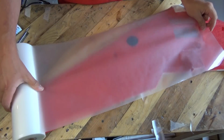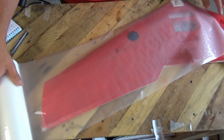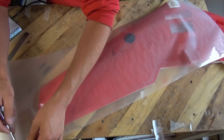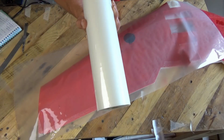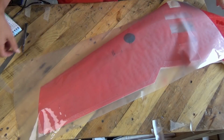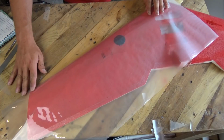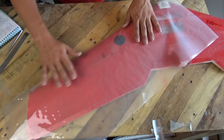Right, again, too much overhanging over there. You can't see it, it's off the side, but you'll have to trust me, there is a straight edge over there, and I'm going to cut this too big. Again, I'm going to overhang by about 3-4 inches on the side. Remember, laminate is expensive to buy a roll, but per metre it's really cheap, so don't hold back on it, it's okay to cut it too big. Right, so again, I'm eyeing this up, I'm leading it over the front edge by about an inch, as long as it's uniform all the way along the leading edge.